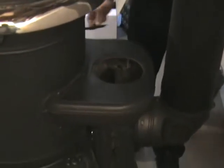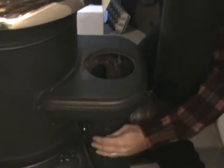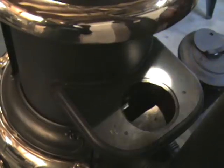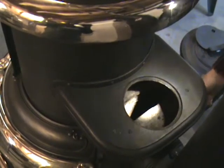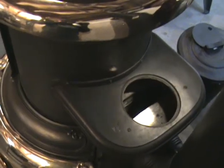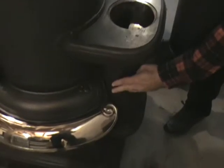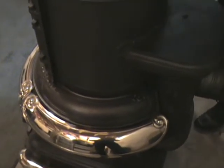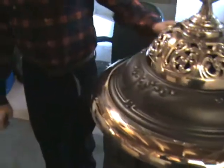I'll open this up and show you. There's a valve here that controls it. One position is for direct draft. If you can look in there, the smoke and heat come out through the exhaust manifold here, and it goes down and up through the exhaust pipe. When you flip this up like this, it goes down and circulates around underneath the bottom of the ash pit, comes up, and then goes out. That adds about 12 feet of radiating surface to the stove. This stove, which takes up a floor space of two square feet, has a radiating surface of over 27 feet. So most of the heat produced by the fire is radiated into the room.